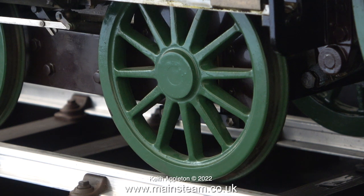The same thing needs to happen on the driven wheels, which if you think about it is utterly wrong. Depending on the type of valve gear — whether external valve gear or Stephenson's link internal — the parts that connect to the axle have been moved in a way they're not designed to move. Stephenson seemed to get it right on the Stephenson's Rocket because the connecting rod arrangement was different: the big end was a ball-and-socket joint, allowing separate up-and-down movement of each wheel. On a modern locomotive, it's all down to the engineering tolerance of the crank pin, the connecting rod bearings, and the coupling rods.